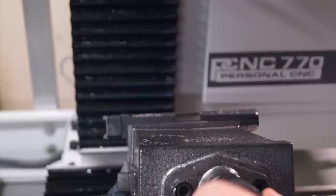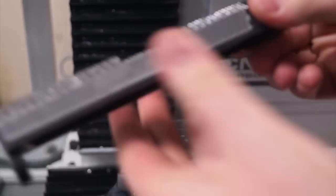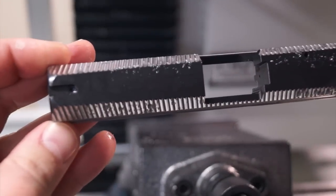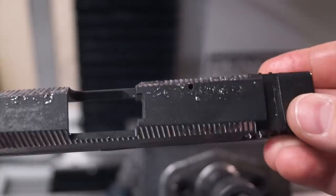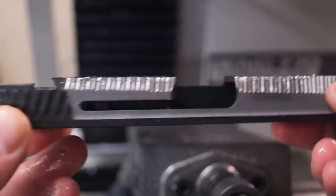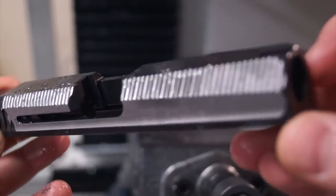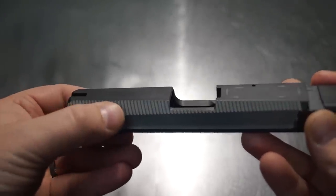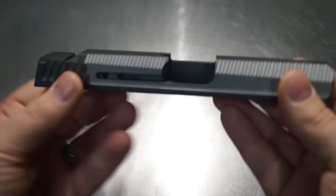Let's pull this thing off and take a look at what it looks like right off the vise. Oh, that is beautiful! Really liking that — really, really aggressive on the hands. What I'm going to do is run this under the sandblaster, get it cleaned up, and bring you guys back to the table. After running it through the sandblaster and deburring the top edges since they were really aggressive, we're now getting that matte color instead of the shiny color we had when we pulled it off the CNC.